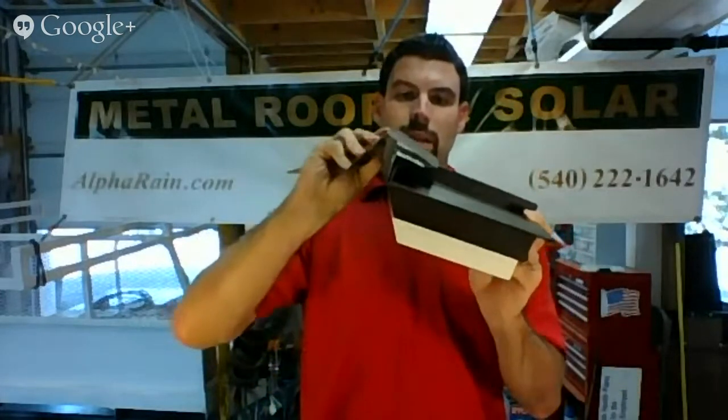We normally put this mesh up about 12 to 18 inches, depending on your attic and what's underneath it. Then we'll actually cut a slice in your attic, and the air will come in underneath our roof and then go into your attic. This has worked very well for customers who don't have any way for air to get into their attic. At the top, through our Vintage A channel and our ridge cap, we'll basically vent your whole attic — cutting a slice at the very peak, an inch and a half on either side, allowing air to escape through where our ridge cap is. That's how we vent an attic.